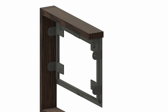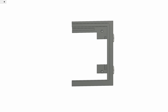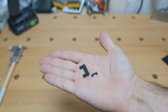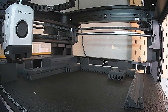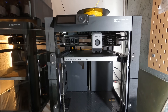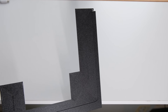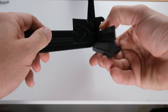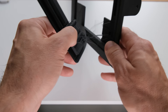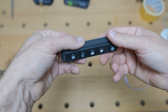I succeeded almost right away. My 3D printer isn't big enough to handle the entire casing in one print, so I divided the model in two and added small brackets to help me align and glue the two parts together. The model was printed on the Bambu Lab P1P, which has a print bed that gives a really nice surface. I opted to print the parts with the front facing down, which resulted in some supports that could be removed quite easily. I also 3D printed a small case for the push buttons along with the buttons themselves, assembling that into one piece to go into the wooden frame later.